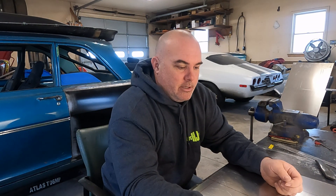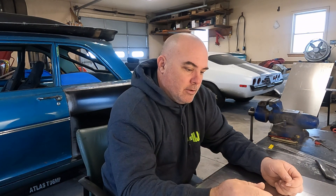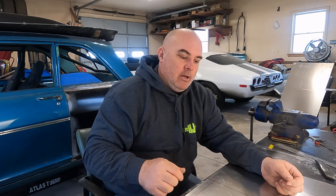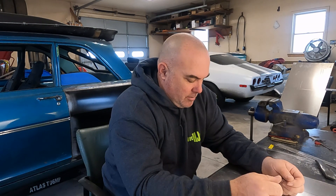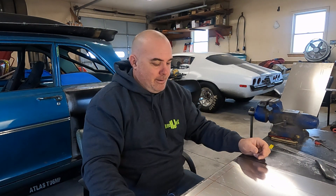Then I bend it over, and I'll do one-inch stitch welds every two inches apart all the way down to reinforce it so I don't have to worry about that. Once I get to that point we'll be working on the base. Hopefully if this all goes well you guys will be the first to know — so far so good, let's move on.